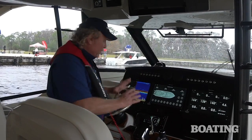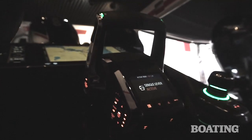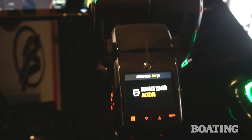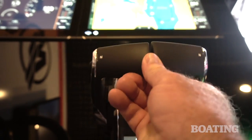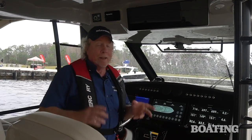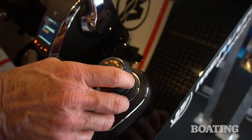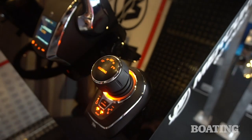The new V12-600 has a new control box — there are two options. This is the standard one; there's also a premium model. The control box has a display screen for engine alerts, and all the activation buttons are on the left side of the engine. To start the engines, press the button right here on the lever. You'll notice neutral or in-gear indicators on top of the levers — that's a great convenience feature. The joystick integrates with the autopilot in a really user-friendly way. You can give it a twist to change course by 10 degrees, or a bump to change by 1 degree. Real simple.